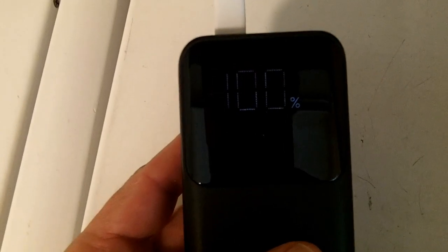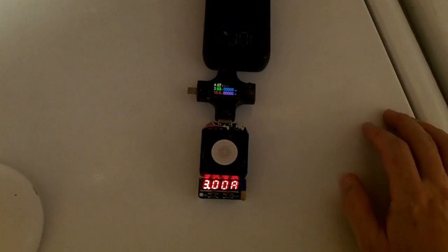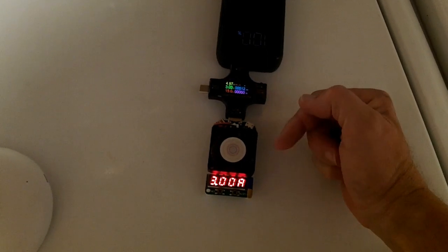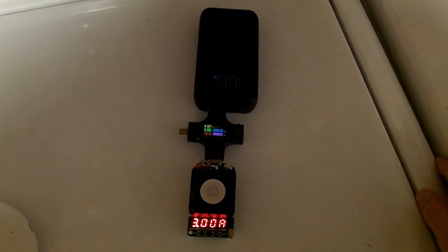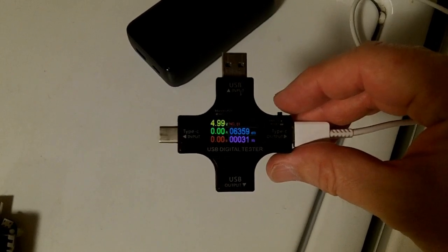This is charged up to 100%. It claims to have a 37-watt-hour battery, and if its conversion efficiency is above 75%, drawing 15 watts continuously it should go for just under 2 hours. After the test, it has turned itself off reporting 0% charge, and the meter reports it delivered 31 watt-hours — which is pretty good for a 37-watt-hour battery.